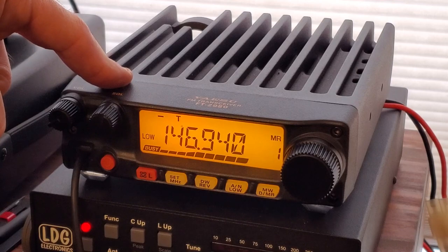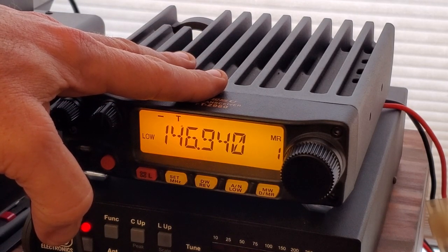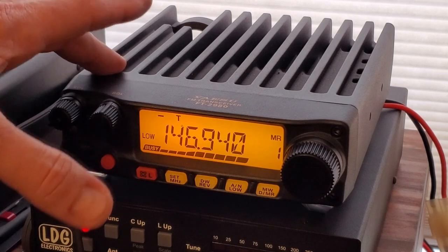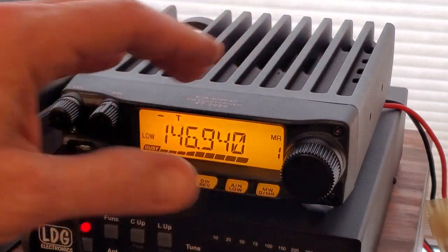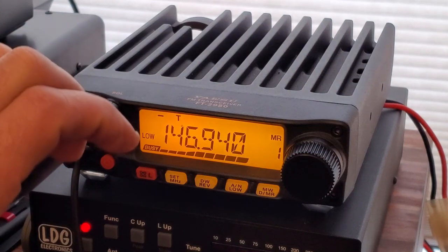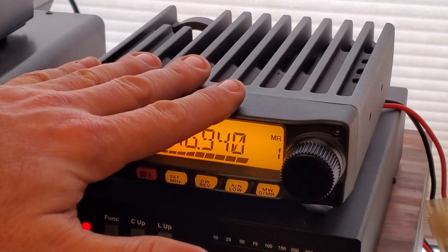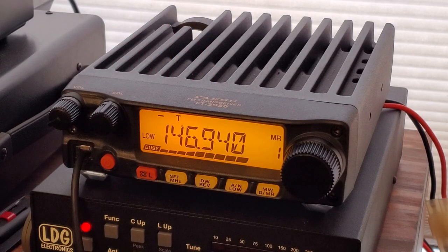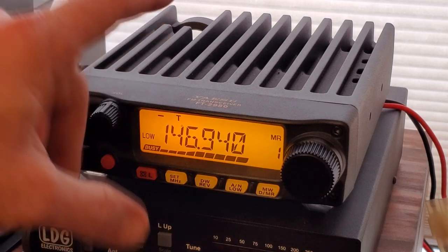I've got this set up for my repeater. You can see this massive heat sink on here — it's like this much radio and the rest is all heat sink. This thing weighs about four, four-and-a-half pounds, but it's a very solid radio. The speaker is on the bottom, which is why I have little rubber feet on it, because I'm not using the mobile mount, and that allows the speaker to bounce off whatever surface it's on so you can hear it better. Massive heat sink, 80 watts of power with no cooling fan needed. It's got a nice loud 3-watt audio output for noisy environments, a six-digit backlit LCD alphanumeric channel display, 200 memory channels, CTCSS and DCS encode and decode built in, versatile scanning, weather channels with severe weather alert, smart search operation, DTMF direct access microphone included, wide and narrow deviation selection.